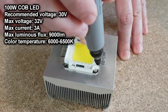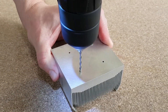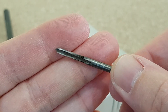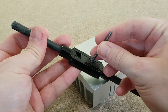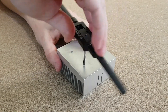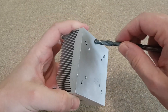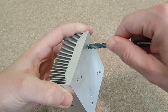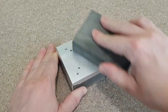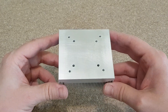To mount the LED on the heat sink, first I will mark the 4 holes. Then I will use a 2.5mm drill bit. This is an M3 thread tap — it looks old, but it does its job well. I will use it to carve the threads inside the holes for some 3mm screws. You need to rotate it a few turns forward and one turn back. I made a total of 8 threaded holes on this side for the LED and bracket. Now I will use a bigger drill bit to clean the edges of the holes, and with a fine sandpaper sponge I will make the surface smoother. The heat sink looks nice so far, but is it good enough to dissipate the heat from a 100W LED?